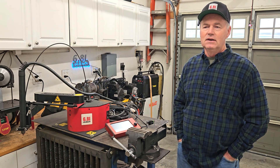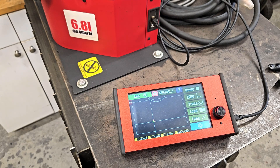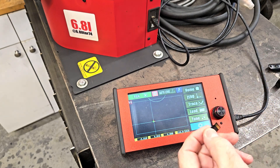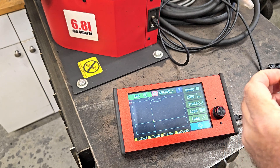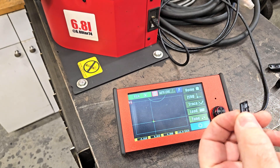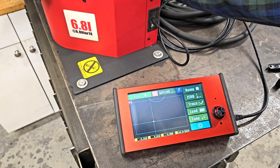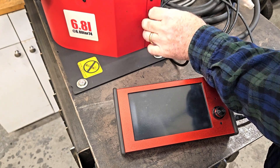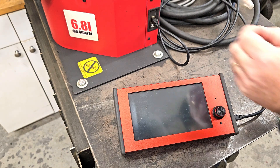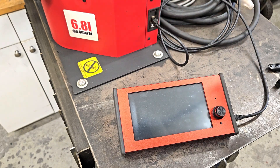The first step to upgrading this thing is to turn it off, and we'll put in this micro SD card. The only thing on this chip is the contents of the firmware upgrade - completely emptied, formatted in FAT32. Then unzip that file and put the firmware on here. So I'm going to turn the ArcDroid off, try to slide the chip in the wrong direction, flip it over, and slide it in the right direction. Now the chip's in there, I'm going to turn it back on.